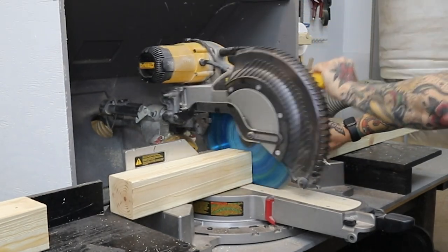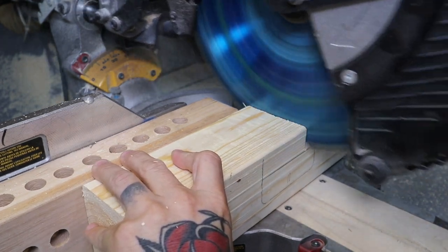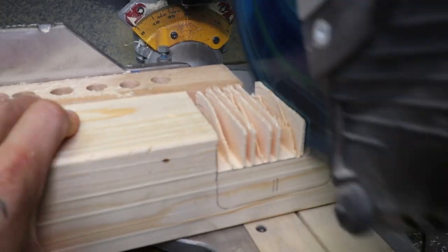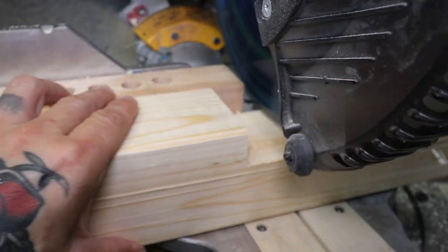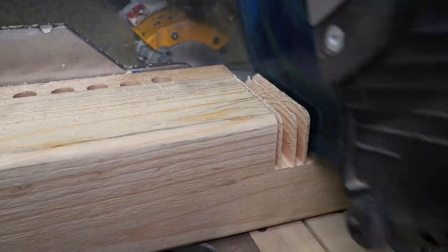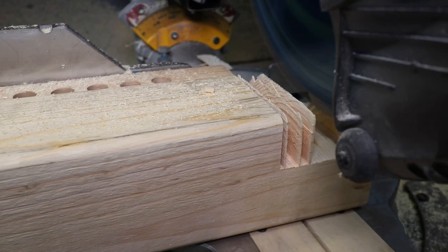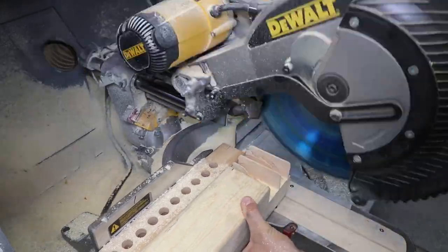I'm using scrap pieces of 4x4 for this. I like the idea of using lap joints to give myself slightly higher elevation than just having a 4x4 sitting on the ground. For those who aren't familiar with the various types of wood joinery, a lap joint is where you cut a little notch out of each piece of wood so they sit together, kind of like Lincoln logs. You can use a sliding miter saw with a depth stopper, a radial arm saw, or just about any circular saw for this. I'm using my sliding miter saw. Once you've marked your width and set your depth, just start making passes until the entire section is cleaned out. I do this in the center of the two shorter pieces and the ends of the longer pieces.